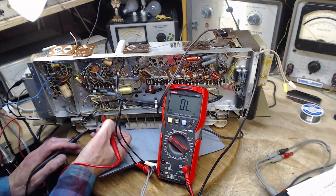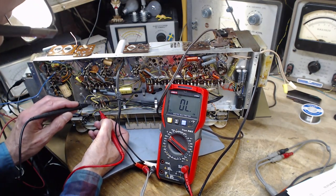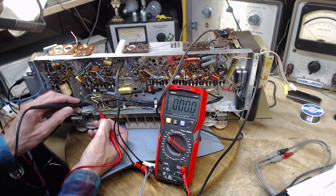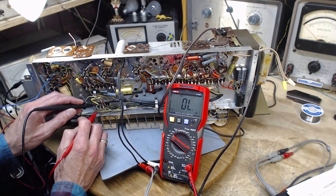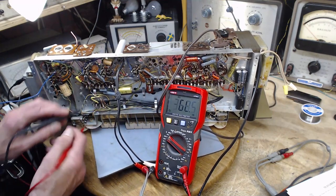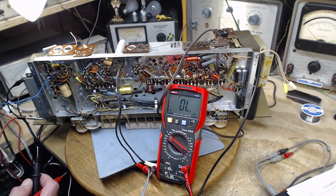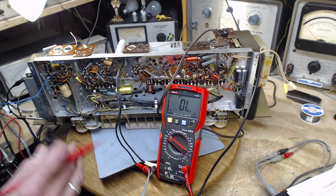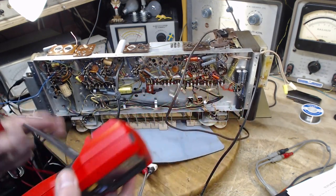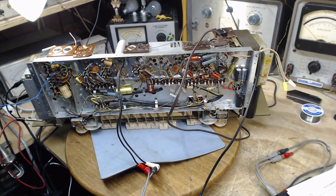Because these are in a circuit, you have to take these results with caution. They're zero, but they could be putting shorts right across these on purpose to get them out of the circuit, depending upon where you're pushing these buttons and everything. I don't want to analyze all that. I've got to figure out where the signal comes out of here and check it to see what it is. I can't find any shielded cables for it. Yeah, study the schematic. Maybe there's a hint there.